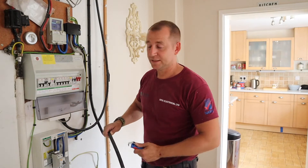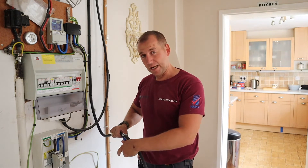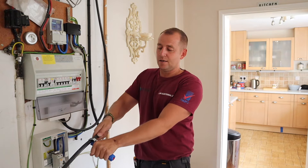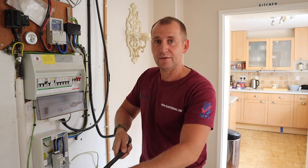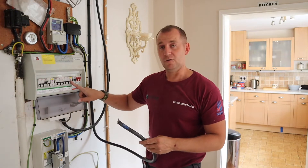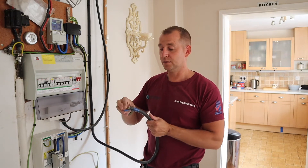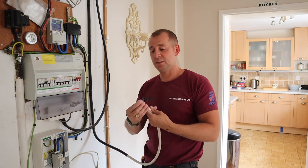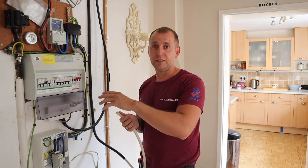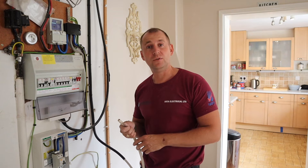The moral of the story here is: when you're quoting these jobs, check, check, check, and check again. Make sure you've got the wording right and don't get caught out. On this occasion it was just a bit of miscommunication and there's no problem. Honestly, by the time I factor in the cost of a Type A RCD, I'd much rather just put the new board in and take a small hit. If you're renovating your house and you haven't got an electric car yet, it's a really good idea to get someone in just to run a cable from the consumer unit out to an outside wall — just put a junction box there — and then you're ready to go. It'll save an awful lot of upheaval later on.